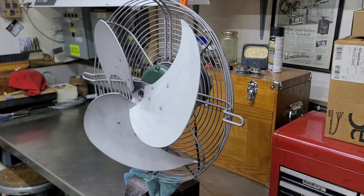I did make some alterations to the winding. Same wire gauge, same number of turns for all the coils, but for the connections I pulled out six leads. I made it so you have access to both ends of all the windings — both ends of the start winding and both ends of each run winding. I like that for troubleshooting; it's easier when you have access to everything and can separately check all the different components. You'll typically see these with five leads, where lead number five goes to the capacitor and leads one through four are for the two run windings. The motor originally was a seven-lead design with a thermal switch, and I never liked those seven-lead motors. I think they're pretty terrible — if they're still working, just keep an eye on them.